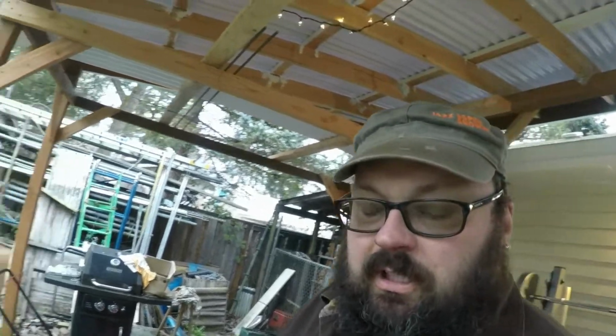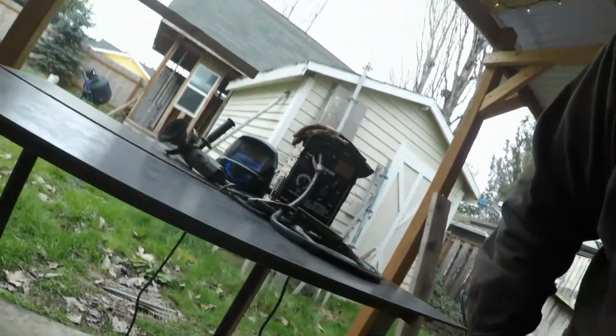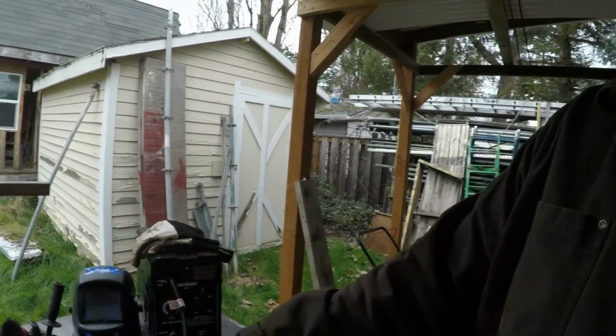Anyway, thanks for watching. I didn't film the welding of the plates to the table. I used clamps to clamp them down here. See, I clamped them to the cross members there, and I tacked them about every 6 inches. I think that will be strong enough. I mean, this is 1/4 inch steel. It's heavy enough it won't move on its own, but by tacking it about every 6 inches, I don't think it's going to move at all.